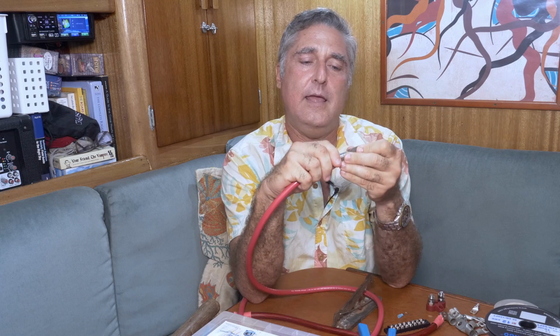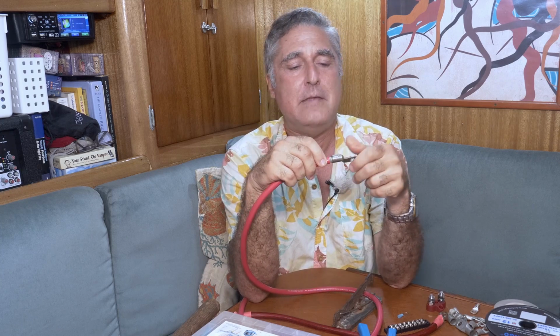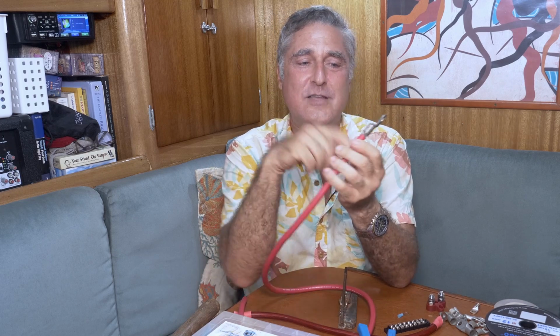Now, you might say, yeah, sure, that looks like a good idea, but I solder mine, and that's way better. It isn't. I soldered all mine first thinking I was doing a better job. And honestly, I was lying in bed one night and I suddenly realized, oh my God, I've done the stupidest thing. The next day I bought this very tool. You can use the tool and solder them afterwards because that will kind of seal up everything and keep the corrosion from happening and lower the resistance. And it's a wonderful idea, but you need the physical connection.